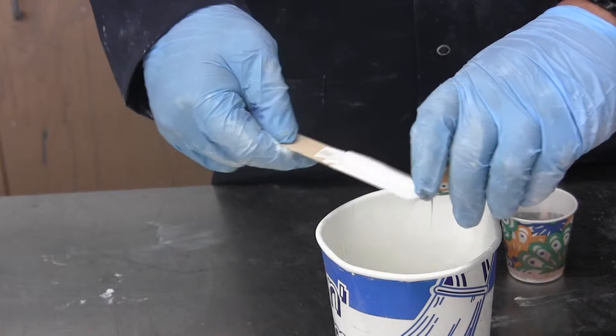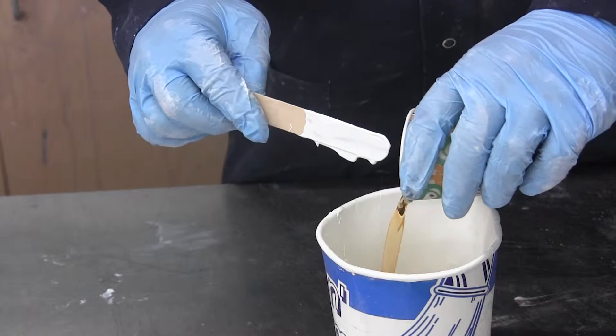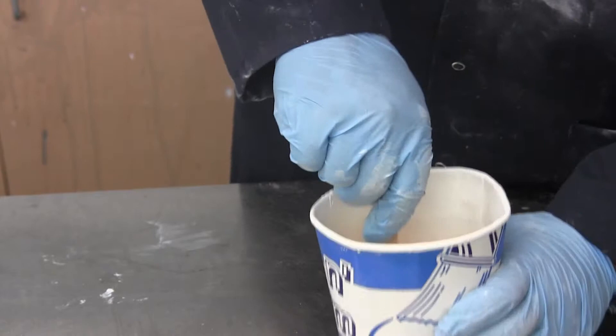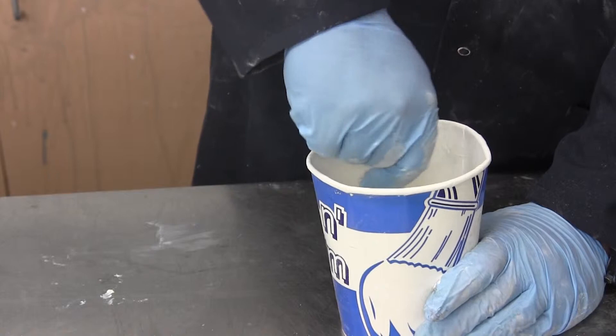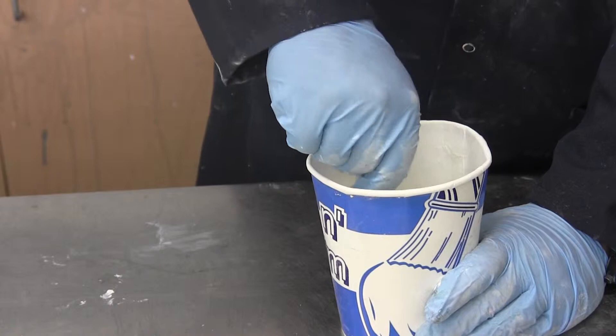There is no induction time on this epoxy — you pretty much mix it up and it's ready to put on. Ryan is going to mix it up volumetrically measured at 1A to 4B and we're going to brush it out on our rusty island over the rusty spots, and we'll put it on a drawdown card in the laboratory just to show you how it applies.